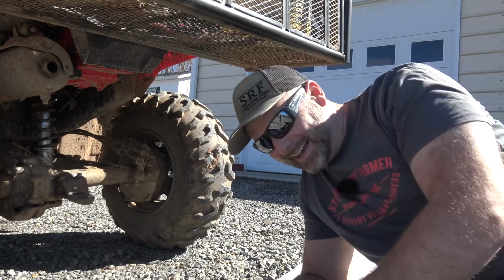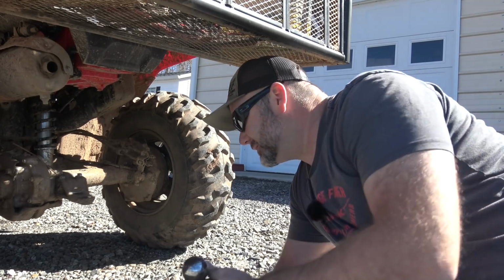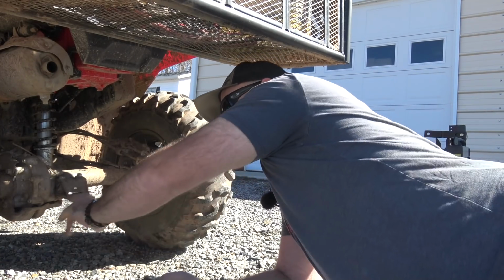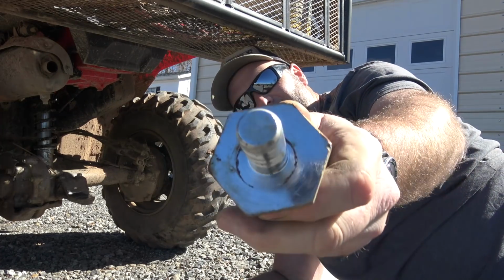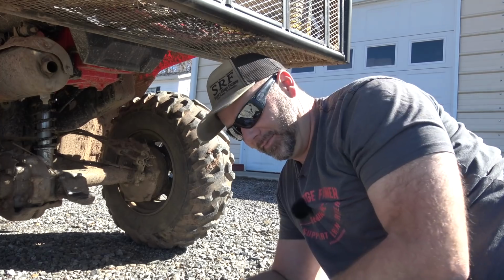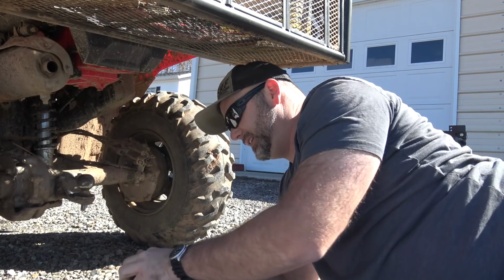All right, we got her. I had to pull one of these off of my other receiver. That's a 2-inch ball. That's what the Greg Judy baling roller takes, a 2-inch ball. When you buy a ball to install on anything, I recommend buying one that you can put an actual wrench on. It's very, very helpful. And again, we'll put a little bit of blue thread locker on this guy. Drop him in, perfect fit.